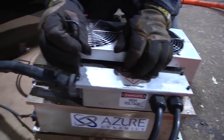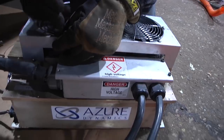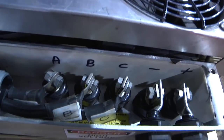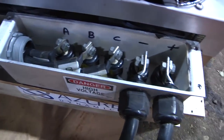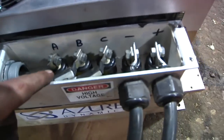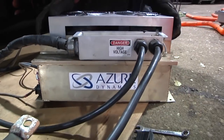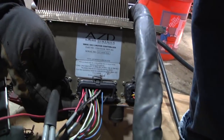Inside the motor cable we'd expect three wires for three-phase power. Really simple — two big terminals coming in, three big terminals going out: A, B, C, negative and positive. Not a whole lot of anything wacky there. So for example, if we wanted to make this cable shorter, we could unbolt these, disconnect that, pull it back, and trim it — but no reason to mess with that right now. Interesting that none of them are labeled inside, but there's the label we're looking for — we'll get a still photograph close-up of the make, model, and number.